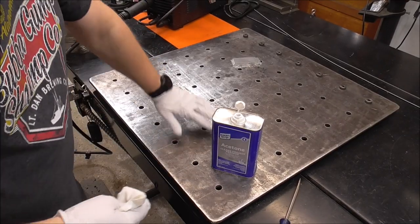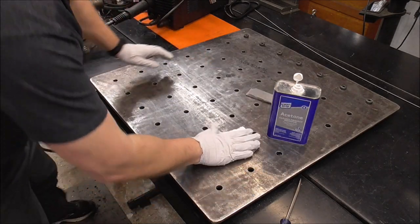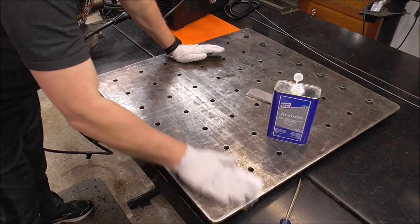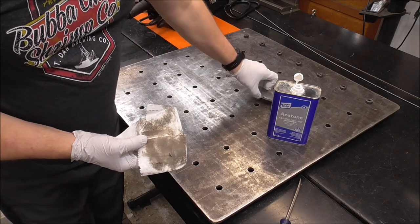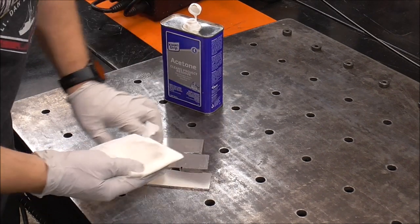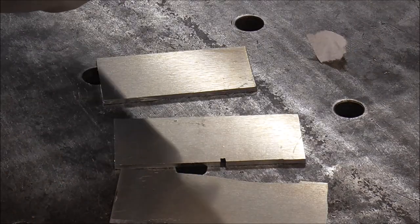Now that we've got our aluminum pieces, let's work on getting that welder dialed in. One of the first things I like to do is clean up my work surface, because it's really important that when you weld aluminum it's super clean. Take a little bit of acetone and wipe down the work surface - get the grease and grime off, any anti-spatter from projects before. Look how filthy that is - that grunge and grime would have transferred back onto our clean aluminum pieces. Now wipe down the aluminum itself to get off any fingerprints, grease, and oil.